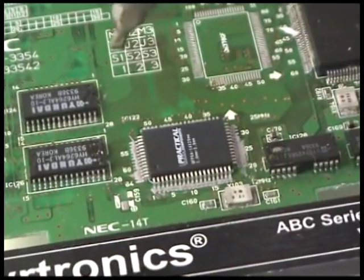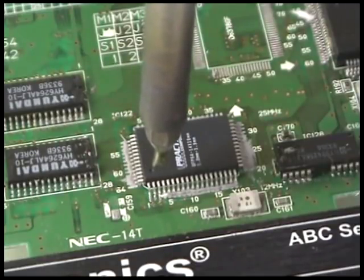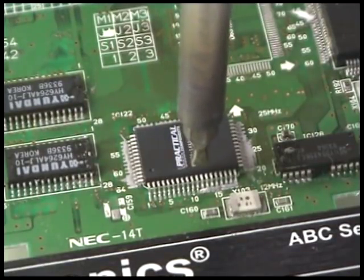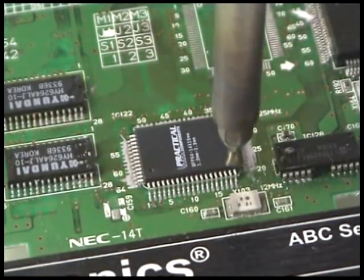After removing the air pencil from its pyramidal holder, begin solder reflow by focusing the heated air stream directly onto the shoulder of the leads of the component, which is in this case a quad flat pack. You can actually see each and every joint reflow as the solder wicks up the lead land interface.